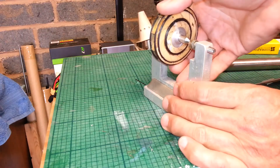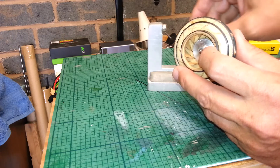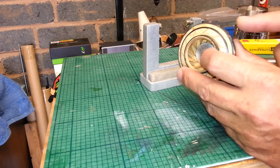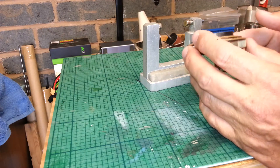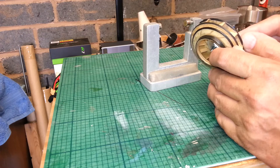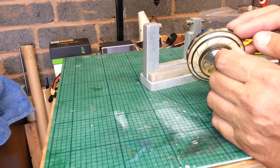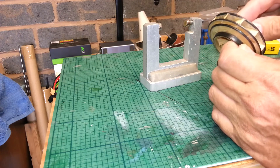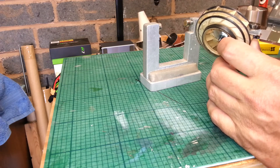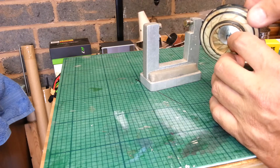I'm just going to give you a few more tips. Make sure you use one millimetre plywood — Umar has done that and those are safe blades. There is some size you can get which is only like 0.8 millimetre plywood, but Umar's got near enough one milli, so that's good. In the book it's 7.2 — that's optimal for this. This has gone a little bit big, so just be careful of your gap. You definitely don't want to be any bigger than seven and a half, as the air flow starts feeding back in the wheel at higher pressure. Keep this gap to less than seven and a half. It varies a bit — it's bound to, it's plywood — it's at 7.4 or 7.5.